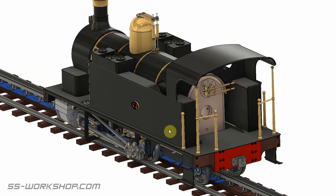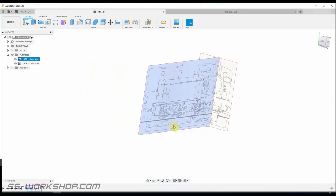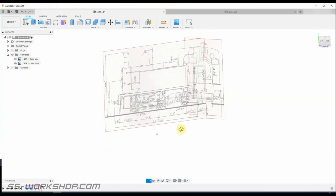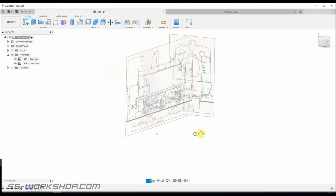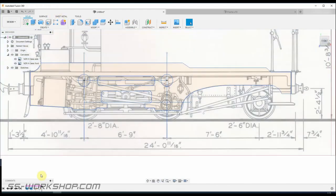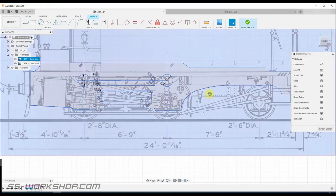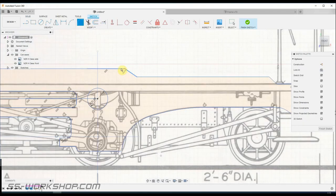Right, let's start drawing. My first step was to start with my front and side views, setting these up in the 3D CAD software. These are scaled to match the scale of my locomotive and will provide the reference as I start to draw the first parts. The next step is to start sketching the outline of the parts, starting with the frame. This will probably take a few goes, and you might even need to use some photos and other references to work out pieces hidden by the tanks and other parts of the loco.